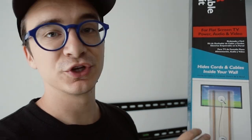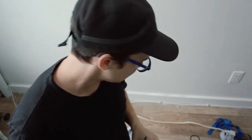Next thing I'm going to do is run the cables. Generally what I see people doing is just running the cables down the wall and getting a little cord cover, which is perfectly fine. I personally would rather have everything in the wall, and if you don't want to pay for an electrician to put a plug up here — especially in an apartment — you can actually buy one of these in-wall power cable kits. It has a power cable rated for in-wall use that runs from the bottom to the top, with a small extension cord that runs to an outlet at the bottom plate and up to the top where you can plug your TV in. It also comes with everything you need to pull your HDMI and other cables through the wall. You are putting two large holes in the wall, but those are easy to patch with a wall patch kit whenever you move out. The kit even comes with the drill bit you need to cut the perfectly sized hole for the plate.